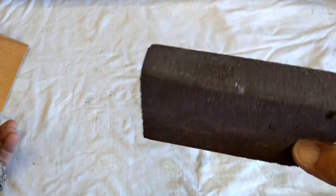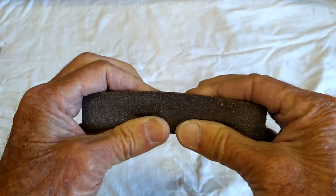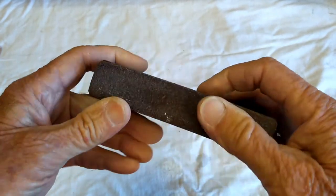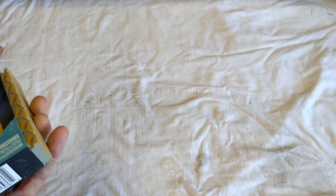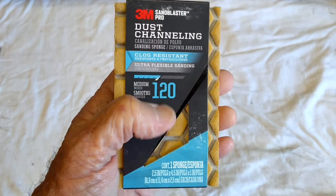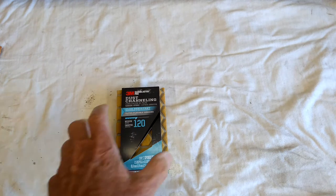How do you sand down into a crack? Use one of these — a soft sanding sponge — because it will go down into the little nooks and crannies, otherwise known as crenulations. If it's soft enough, the sanding surface will conform and go down in there. So I went and bought a couple of these to give it a try. Here's one from 3M, but there are several manufacturers. This one's too soft and too fine at 120 grit, so I went and got three different ones.